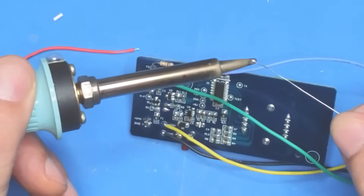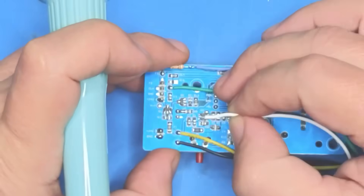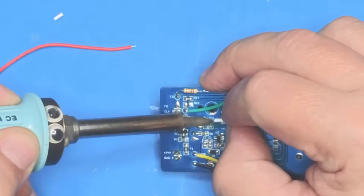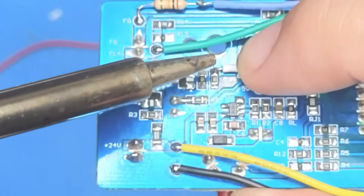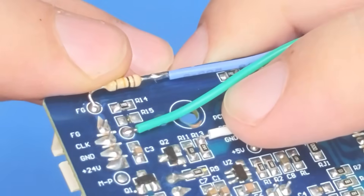I'm going to clean my solder line, put a little bit of solder on my iron, and bend this wire into a dog leg so I can hold it above the board but still push down on R13. I'm just going to heat the wire up so the heat goes through and melts the solder onto R13, then hold that down. I'll just tap that off to make it a little bit neater. So that's all the wires connected to the board.